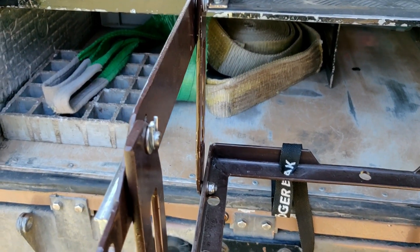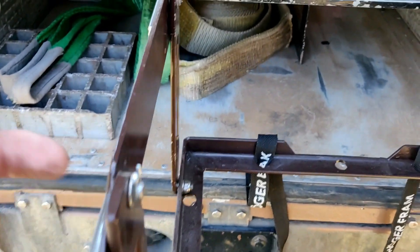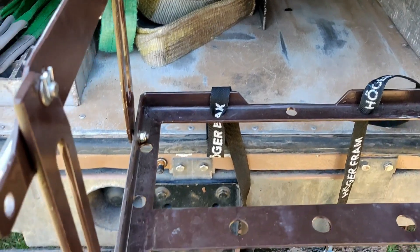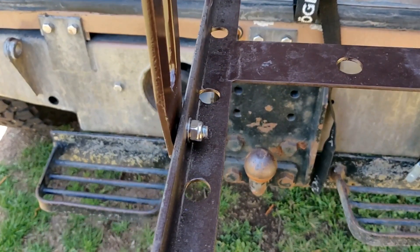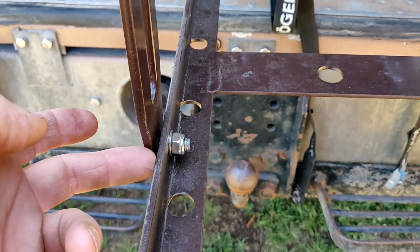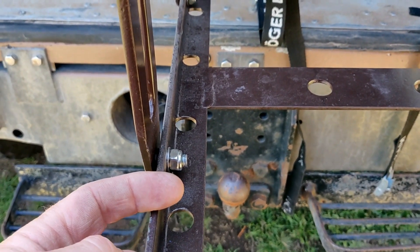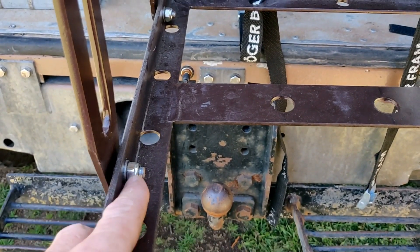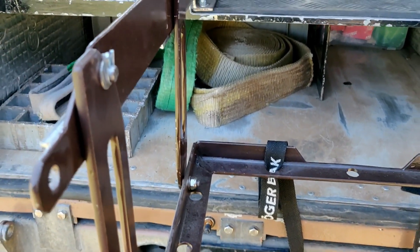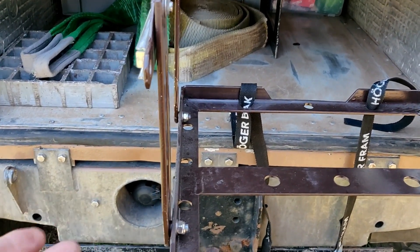When I did the welding, I had everything assembled together so that it kept the pin straight. All my pins were straight. Down on the bottom, I'm doing an experiment — I used the M8 bolt, still threaded from the drop arm all through to my tray. I want to see which will wear first. I'm going to run this experiment for the summer and see how it goes, then change whichever one doesn't hold up.